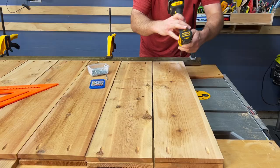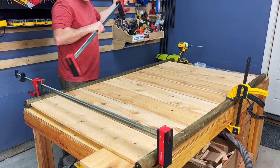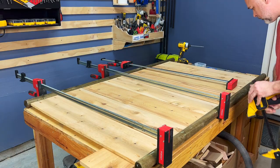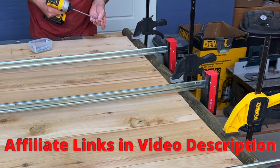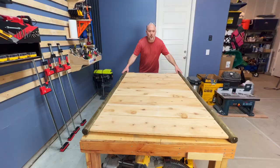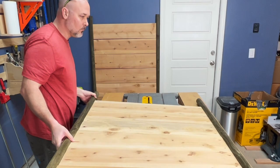Putting together these sidewalls of the manger stable was quite simple and easy. Fortunately my workbench was just wide enough to accommodate this build. Once I secured that first stake, it was very simple to use my clamps to secure the second stake and drive those pocket holes in again. I used my Bessey 50-inch bar clamps and DeWalt 12-inch trigger clamps to get the job done. Anything you see me use in this build I'll leave a link in the description. Of course with only one wall this wouldn't stand up for long, so I repeated the same process and made a second, slightly shorter wall.